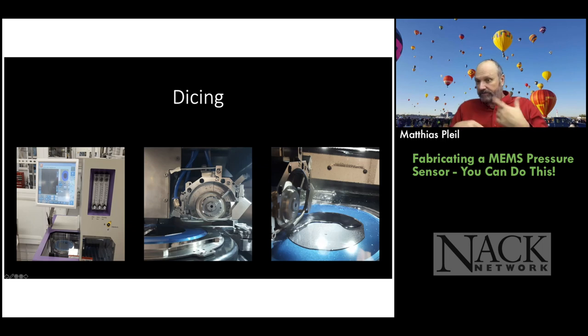Right? Because it's going so fast. You're cutting silicon, for God's sake. That's a pretty hard material, if you look at the hardness factors and all that, and you're using a diamond saw. So it's producing lots of heat and particles, of course, because you're pulverizing the silicon. And so all of this water flow helps keep the particles off of your wafer as you're cutting, as well as keeping everything cool and clean.